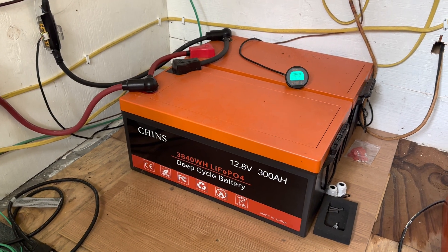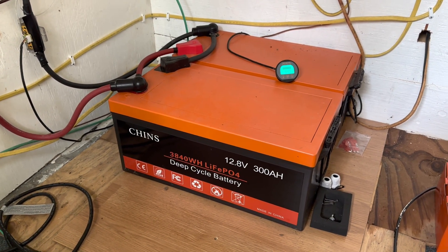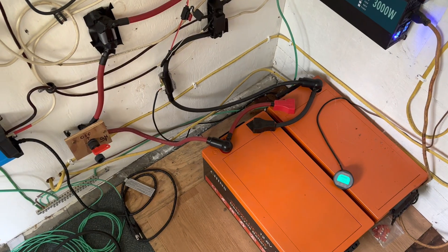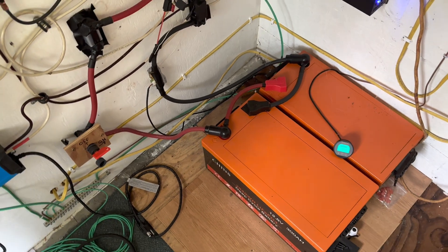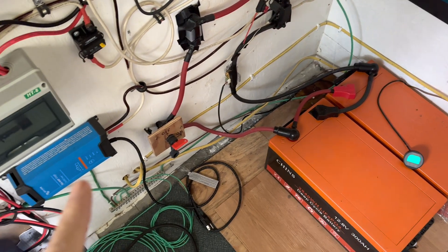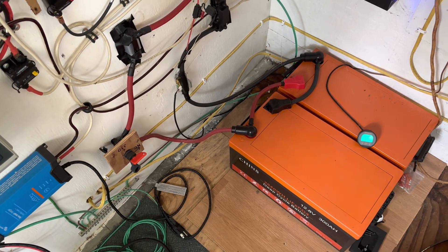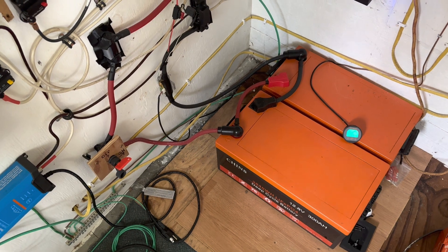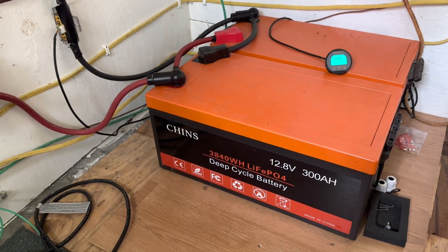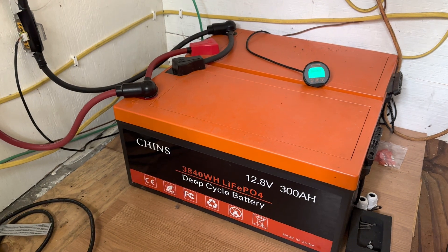Because I want to make them last as long as possible, I always try to keep it at 80 percent depth of discharge or even a little less, as it really expands battery life. If they ever get down to around 20 percent, I can switch my power system over to some auxiliary systems I have, or fire a generator and run the charger to pump them up until the sun comes out. As a general rule I never cycle these below 20 percent, and two years in I've never had a problem — they've never flinched for one second.